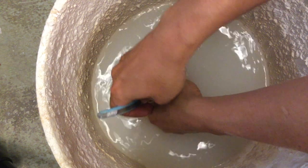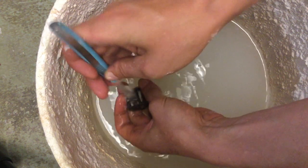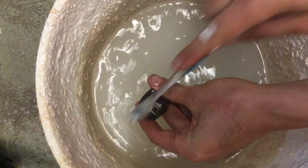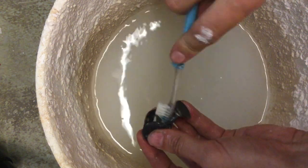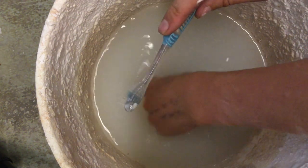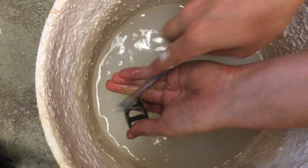If you can't get in there with your big nylon brush, a toothbrush works just fine. You get used to doing all of your work inside a bucket. You want to get all the plaster off so when you take your jewelry to the pickle it cleans up without contaminating your pickle or your sink. All of this plaster in the bucket can just be dried out and discarded. You want your part to get pretty clean and spotless.